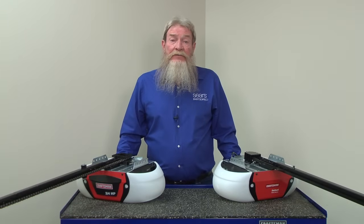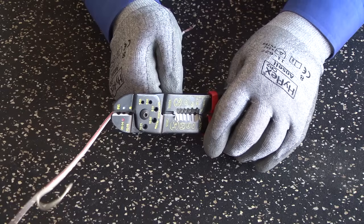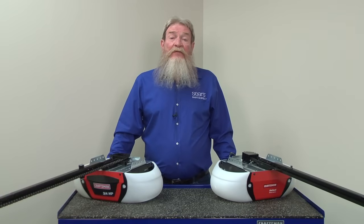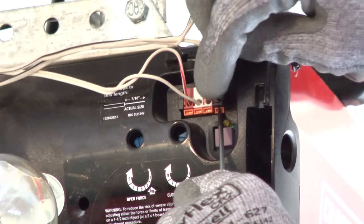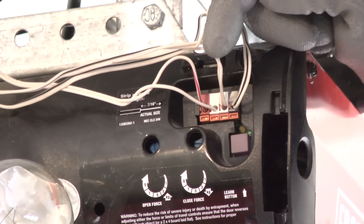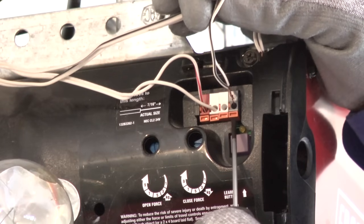If you see one of the first two error codes, check the wiring between your motor unit and the sensors for visible damage. You won't be able to check all the wiring if it's routed through the walls to the sensors. Check the wires that you can see and repair any broken or damaged wiring. A loose wiring connection could prevent the garage door opener from closing the door, causing an error code. Check the safety sensor wiring connections on the motor unit and reconnect any loose wires. Make sure you have the sensor wires connected to the motor unit correctly — the white wires twisted together go into the white terminal, and the white wires with the black stripes go into the gray terminal. Connect the wires correctly if you find them reversed.